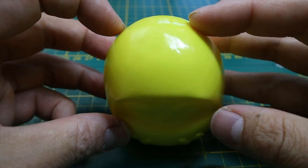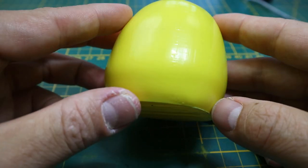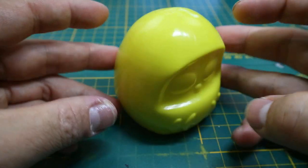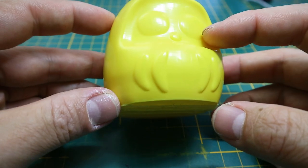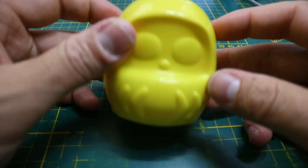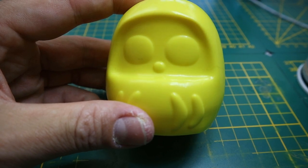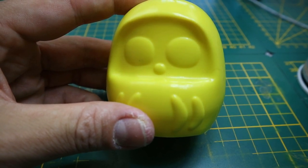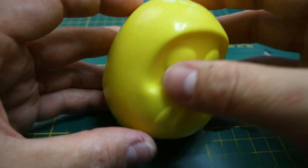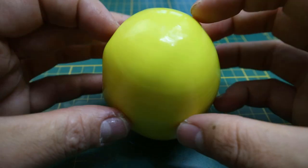Amazon Basics PLA yellow responded great — great shine to it, a lot of the lines are gone. If you want to clear more of it you can repeat the process over and over, but don't go leaving it in for 10 minutes straight as it will just turn the entire thing into goop. You want to affect the outside walls only. Short stint in the pot, take it out, harden back out, and then you can repeat it again. Amazon Basics responds very well.